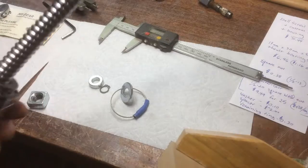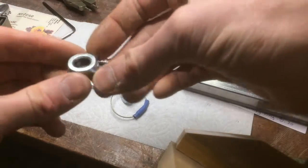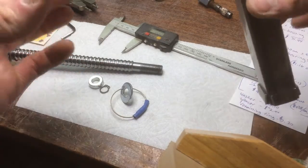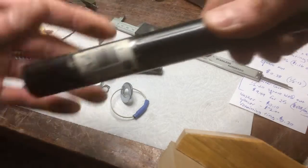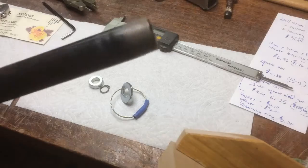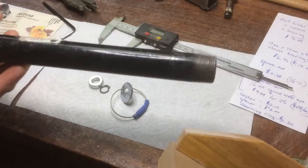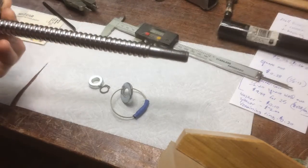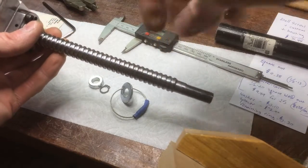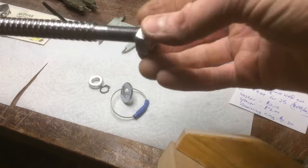This part is our spacer. This is a square nut that fits inside the spacer just enough so that it can't turn. You don't have to do the square nut and square spacer if you don't want to go to the trouble — you could just take a length of black pipe, it's a little heavier but will work fine as a spacer; this is roughly eight and a half inches long. However, it may break more stud bolts you're removing, because if you're really torquing on this and there's nothing to keep the center from spinning, you may be twisting the bolt as you're pulling and you're more likely to break it.